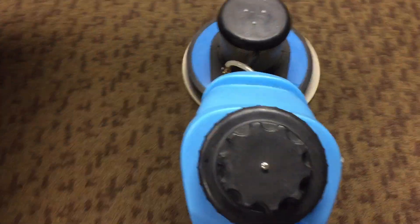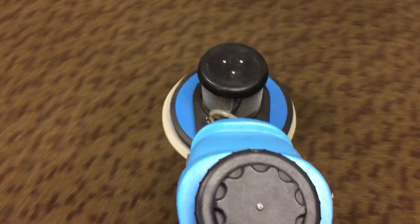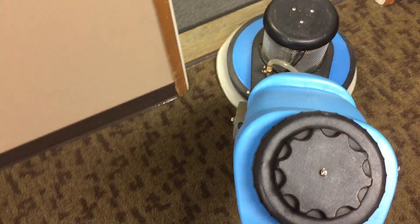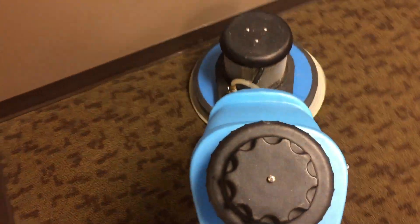Say: first, we're going to give your carpet a very thorough pre-vacuuming, which is standard and proper operating procedure. Very rarely is anybody else going to do that. Most steam cleaners will say their truck mount is so powerful it sucks everything out — even though they know that is not IICRC-approved carpet cleaning procedure. So you tell them: you'll give it a thorough pre-vacuuming and while doing that you'll be inspecting the carpet and pre-treating all the spots and stains you see prior to cleaning.